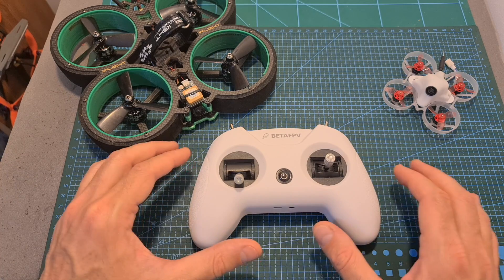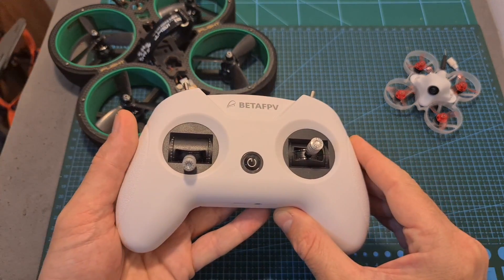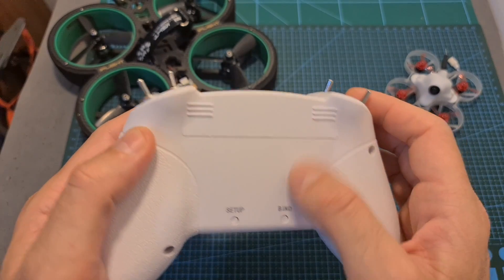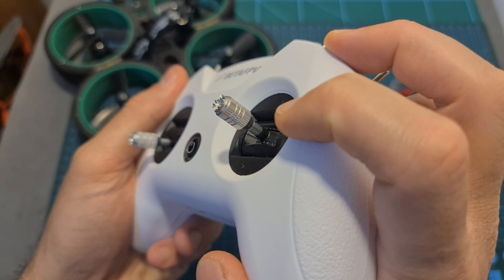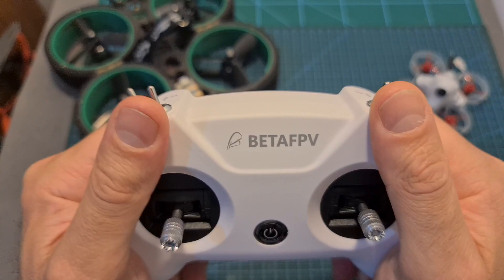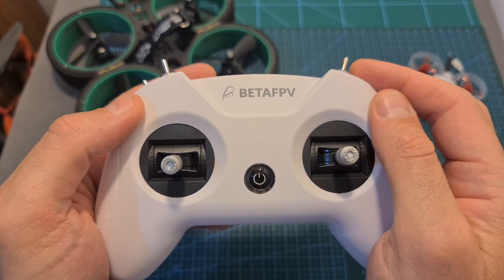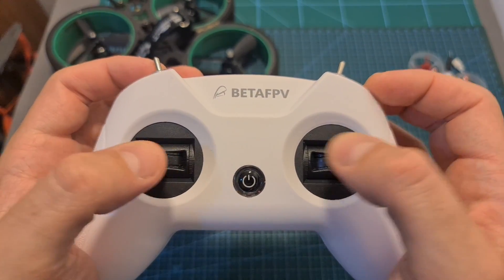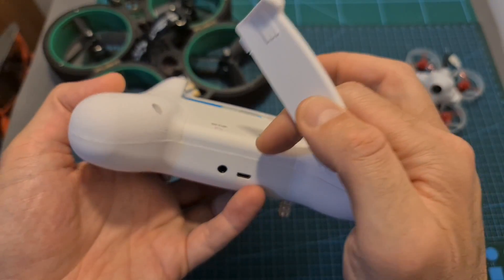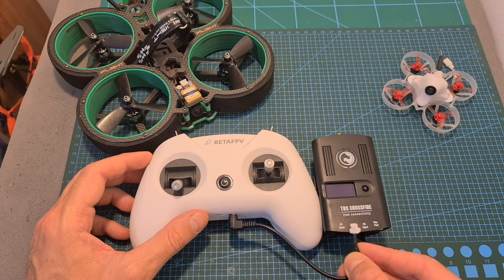After testing the Light Radio 2 for the last couple of weeks with different quadcopters, I can say that BetaFPV surely got themselves a winner — this is probably one of the best compact radio controllers you can currently get, especially considering it only costs $40. It doesn't support an external module, doesn't feature Hall sensor gimbals, doesn't have a built-in screen or telemetry, but for $40 you get a very comfortable and compact radio controller that supports 8 channels, supports different FrSky protocols, enables precise drone control, is suitable for both thumbers and pinchers, comes with a battery lasting about an hour and a half with internal USB charging, supports flight simulators, and even features a trainer port you can connect to a Crossfire device.